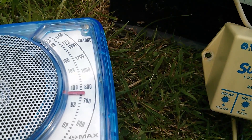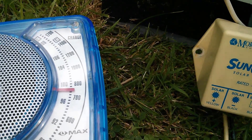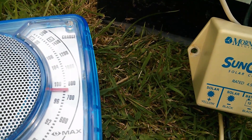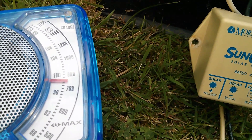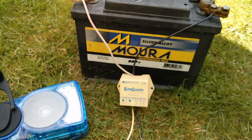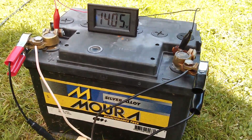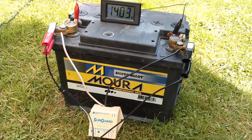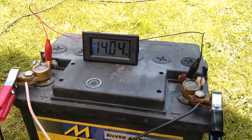Although the frequency is constant, the pulse width is varying. If you've ever played with a synthesizer you'll know what a varying pulse width sounds like — it's a phaser, they used to call it a phaser with a 'ph'. That's pulse width modulation in sound. I've now reconnected the solar connections directly to the battery, effectively taking the SunGuard out of circuit — it's still connected but has no solar connections, so it no longer regulates the voltage and it will just creep up and up.